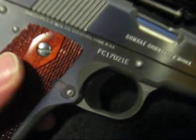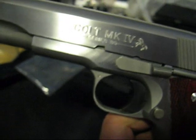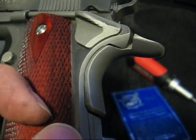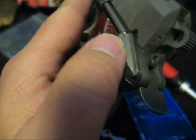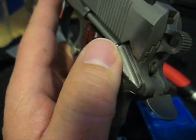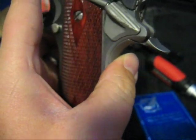This is my wife's Colt Combat Commander, and it is rather nice, but this little duckbill semi-beaver tail is quite annoying. It doesn't let you get your thumb high enough to disengage the safety comfortably, and if you install an extended thumb safety and use your thumb on top of it, as some people do, that little joint right there is kind of irritating.